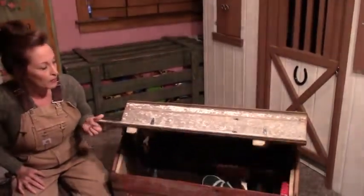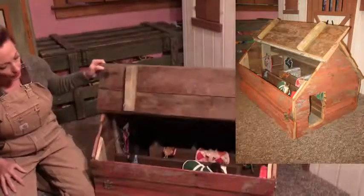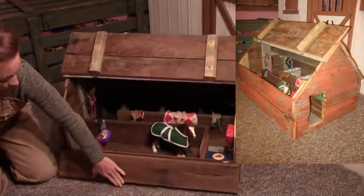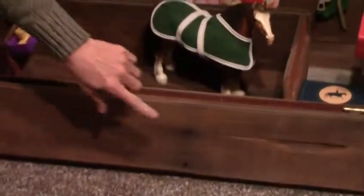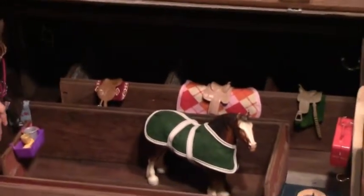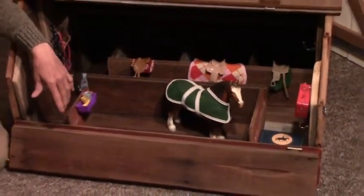We put some hinges on the roof and some hooks on one little piece on the bottom so it can be opened. As you can see on this piece of wood, it's getting pretty old — some of this was actually starting to rot and splinter a little bit, and you can see where the old nails were. When you start sanding boards like this, if it's really looking too rotten, you're not going to use them. There were maybe 10 boards out of 50 that I just couldn't use because they were starting to rot.